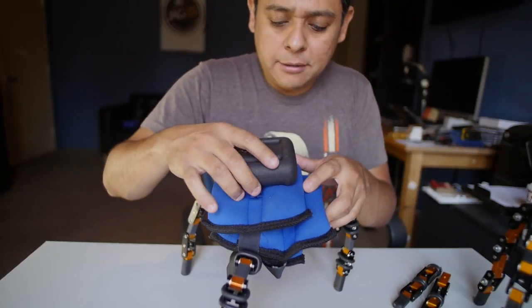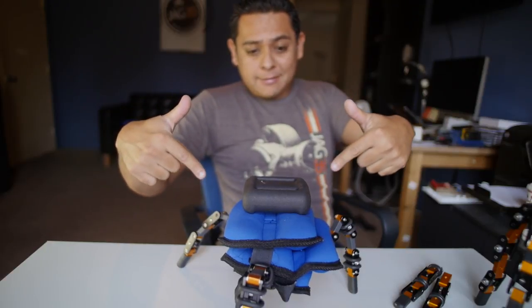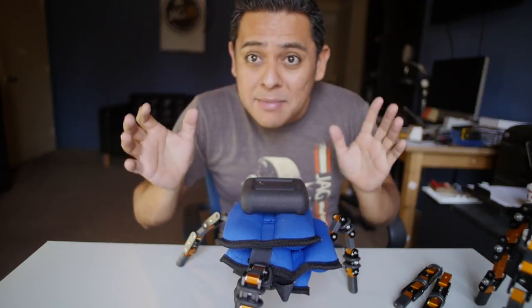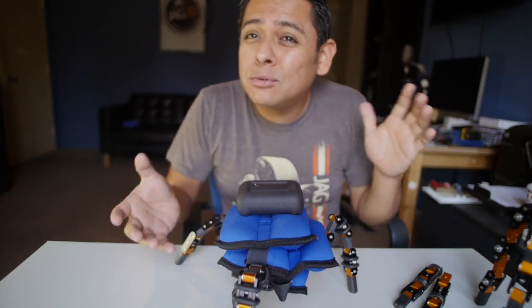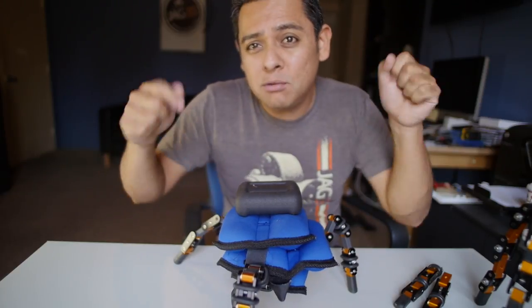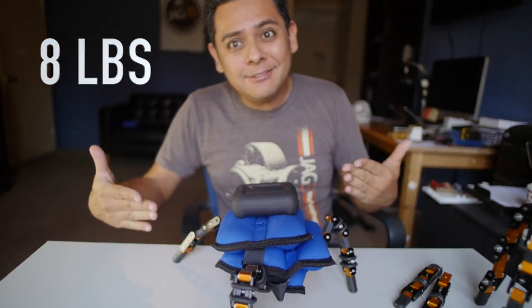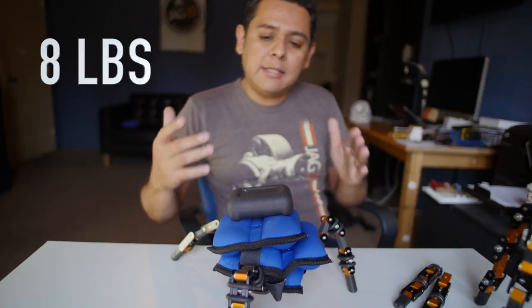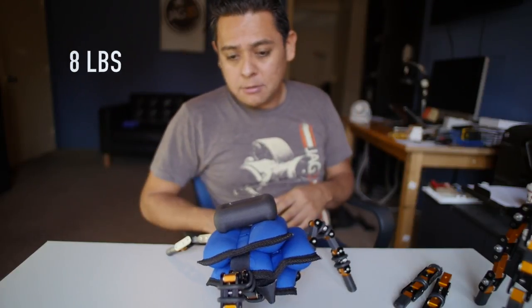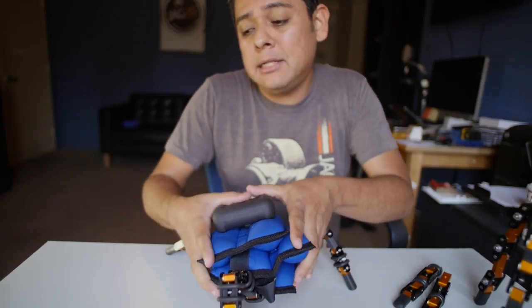Ah, see, that's where it starts going. It's actually going down right now. So the limit using these brass washers, which are the ones I'm leaning towards because they seem to be smooth but hold well, is about 8 pounds. I'd say we can safely say that the 10 inch will hold about 8 pounds, which is a lot of camera package for a tiny little tripod, right?